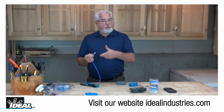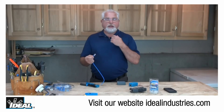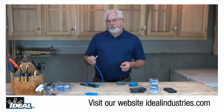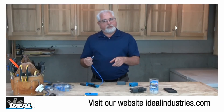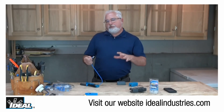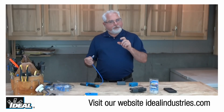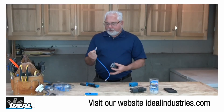At first I thought there was something wrong with the plug and the tab that we were making. I called up product management, and it turns out they'd actually heard this one before. It actually wasn't the plugs — it was that cheaper version of the tool I was using. Because not only was it crimping the pins down like you needed to, but it was also slightly compressing the tab in the connector so it wouldn't snap into the testers like I needed it to.